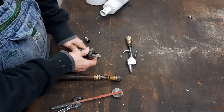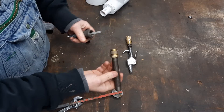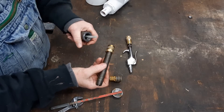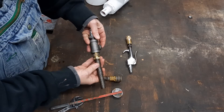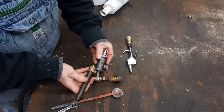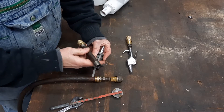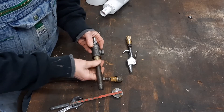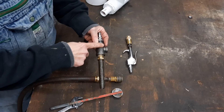I ain't going to tape it up right now — this is a test, but it is going to work, I know it is. Got me a piece of three-eighths pipe and a reducer, three-eighths by a half. I had to make this — this was a brass nipple. I had to cut the nipple off of it, drill it out, and tap it. Sometimes you just got to make do with what you got. That's going to thread into about right there, and this piece of tubing is going to extend past this. This side is where the vacuum is going to take place — as the air is blown through this tube, the tube being larger than this, it's going to create a void on the backside, creating a vacuum.